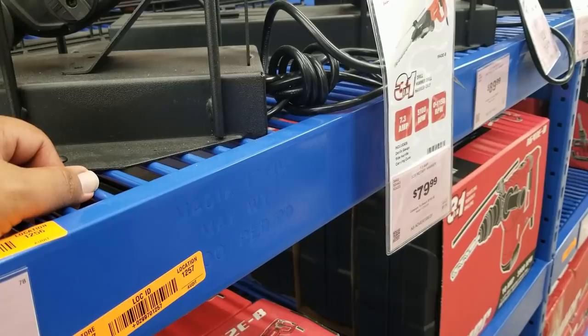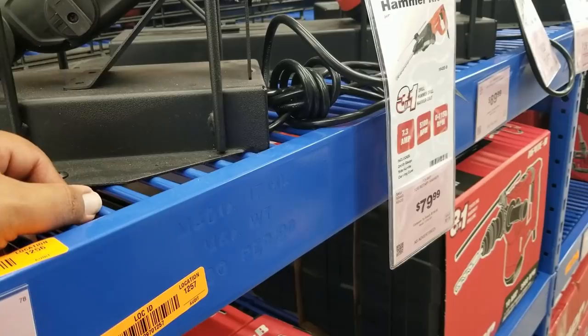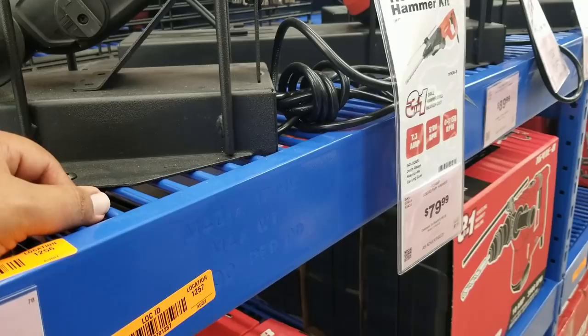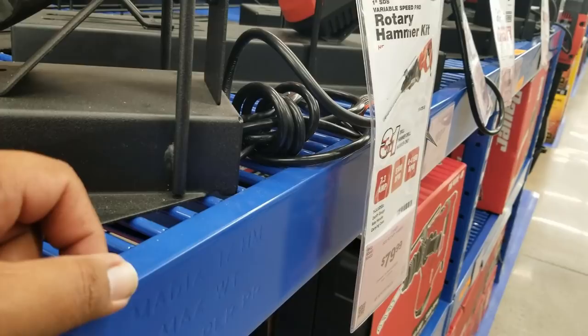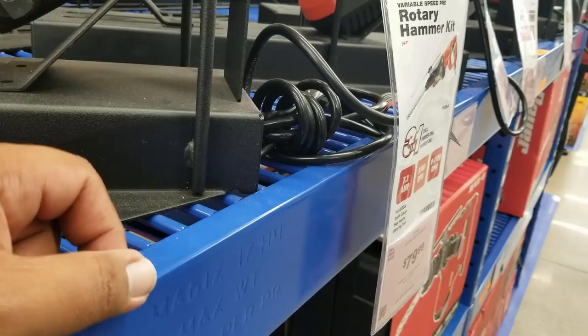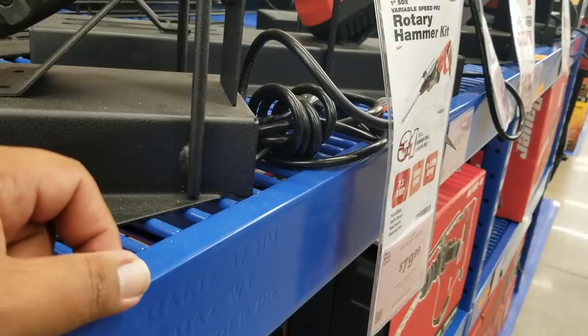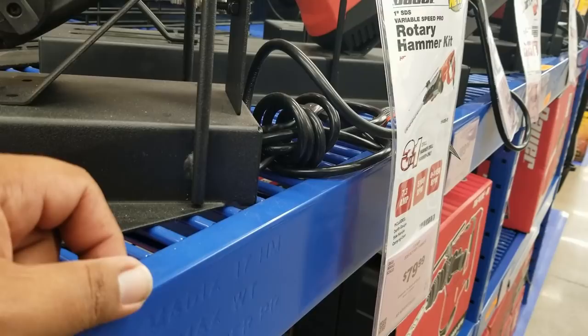Some of the thin set stayed stuck after removing tiles. He said here's a tip that will save a lot of work: use a sledgehammer first. Hit each tile five times - once in each corner and once in the center - then go tile after tile. You don't have to pulverize it, just crack it. Then use the hammer drill after. Otherwise you're sitting there vibrating and trying to pick up whole tiles. If you hit it with a sledgehammer, sometimes the whole tile will pop off along with the thin set underneath. His son taught him that trick - his son did tile and carpet and said just hit it with a sledgehammer.